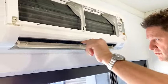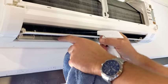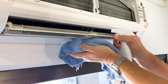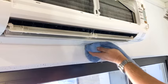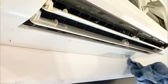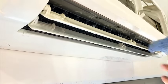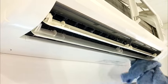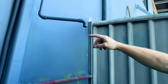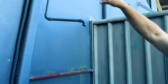The next important component is the fan, which runs the length of the unit down the bottom. We'll just spray straight through to the fan. You can see we've got some residue coming out of the fan which is dirty, so it's doing a good job of cleaning the fan. You may just need a rag to collect the excess that misses the drain. This is the product running out of the drain from the unit, and that's cleaning the pipe as it works its way through.